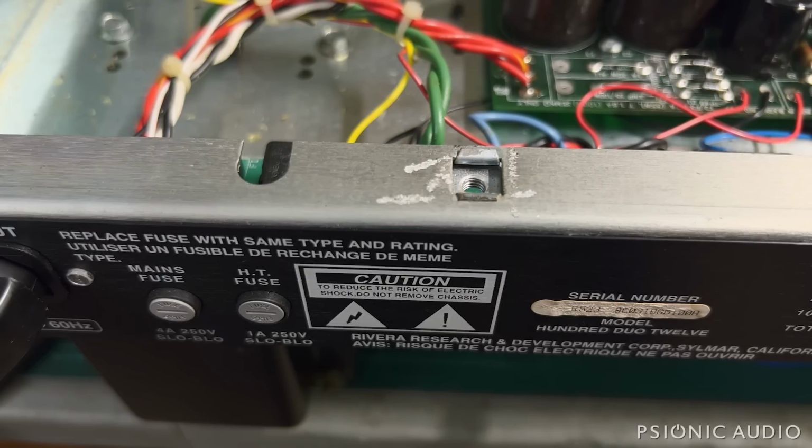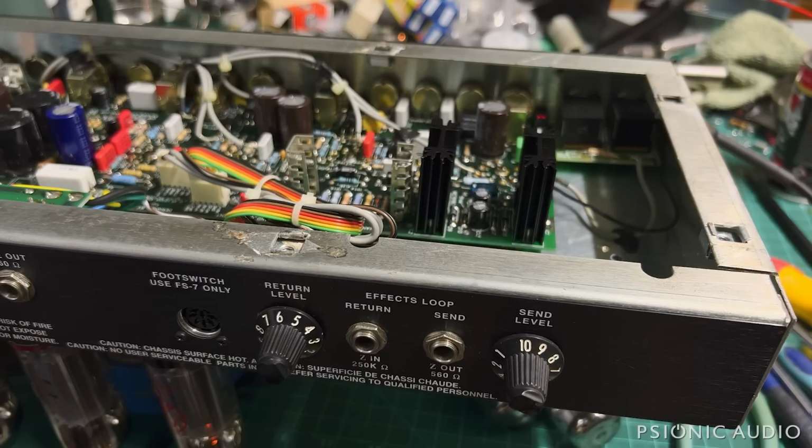Before I tell the guy he needs to recap this amp, which would be relatively expensive given the PCB design and having to take it all apart, I just happen to have a quad of EL34s here. Let me pop those in just to see. The new output tubes made no difference, sadly. And the noise level has come down overall because I changed out V4. I suspect it has some other bad preamp tubes.